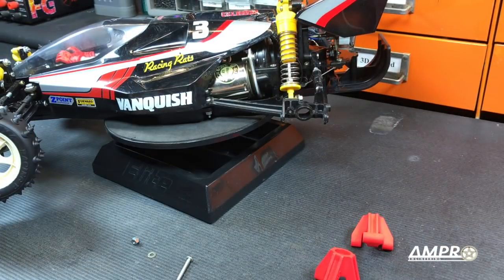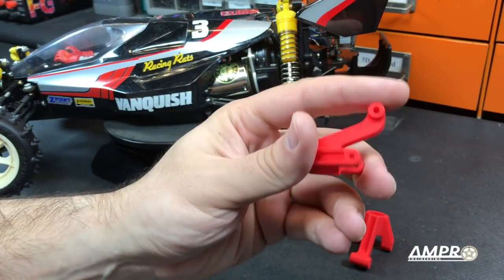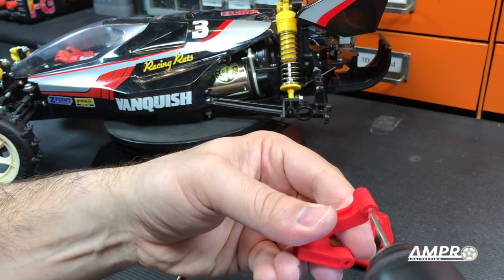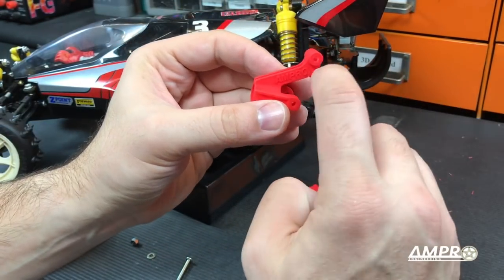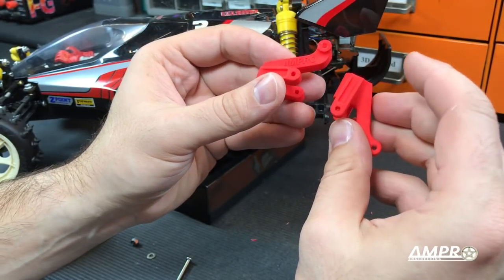You must not use a 3 millimeter bit as you will completely strip out the hole. When you are done with that, you can then put your 3 millimeter bit in and just clear out the top one. The top one is designed to be 3.1. The 3 millimeter bit is just going to clear out any loose debris. All clean. Remember that if you don't do this, you're going to risk binding on the top, and on the bottom, you risk simply not getting the screw started.